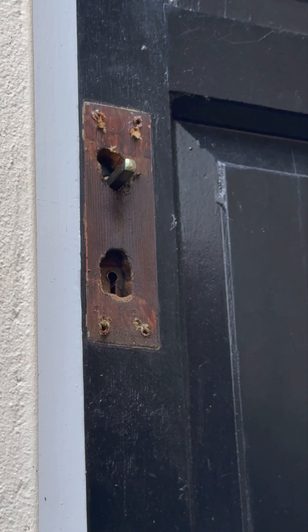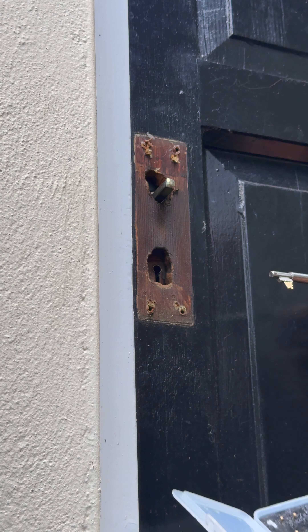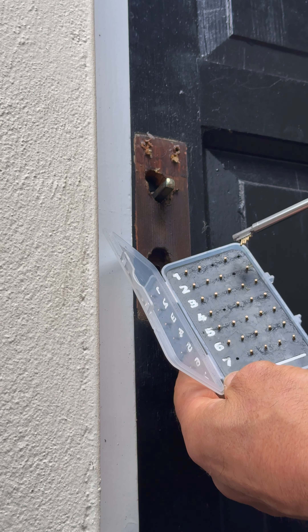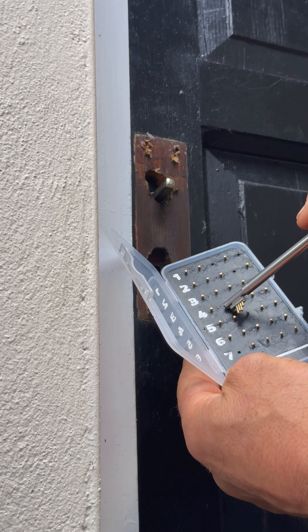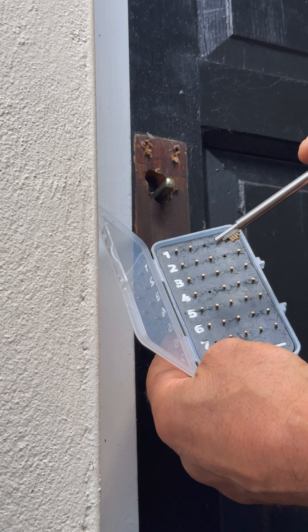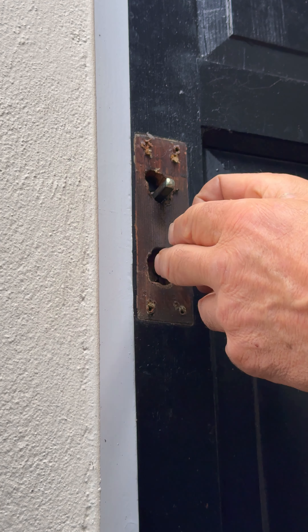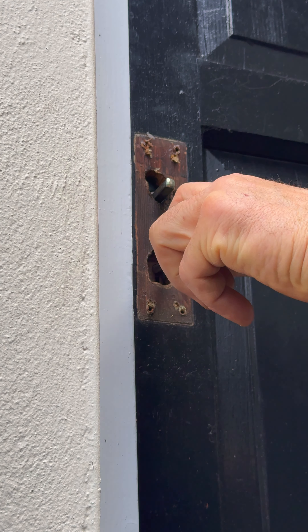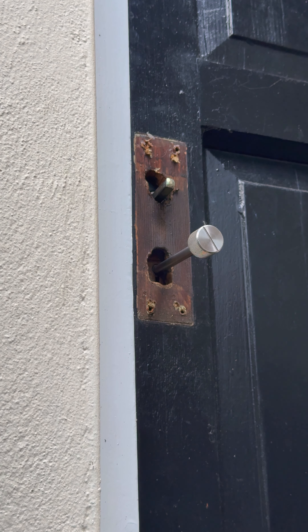I've built the makeup key with a seven-four-one-two-one. I went back and took the readings again and it was quite clearly a four — there was no ambiguity on that, so it was certainly not a five. So here we've got the key — when I put it in and turn it, you can hear that that's the correct bitting for that.